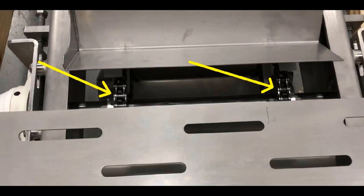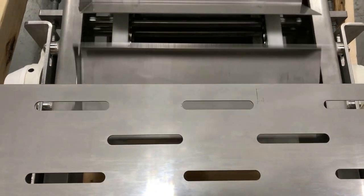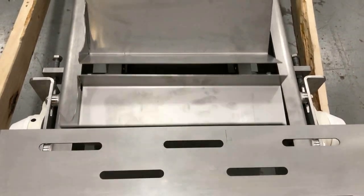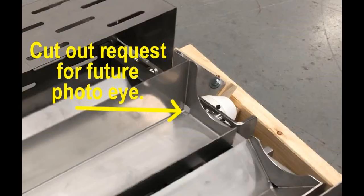Dual-strand stainless steel roller-chain designs may have pre-tensioned linkage with attachments needed for the customized buckets. This design required every other bucket to have a 45-degree rotation.